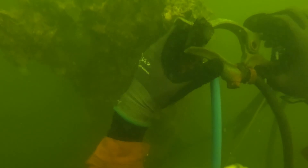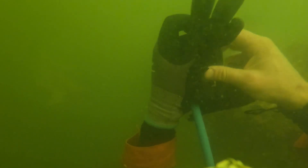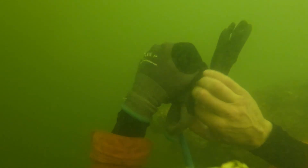Topside just lowered the burning gear down and I'm getting the ground clamp on a piece of rebar that I'm about to cut off. Since we're underwater, we're using direct current electrode negative, so the ground clamp is actually positive in this scenario. I have a full video coming up all about why we use direct current electrode negative — it's for safety, efficiency, and a lot of other things, but we'll cover that in a future video.